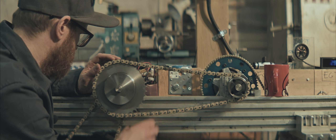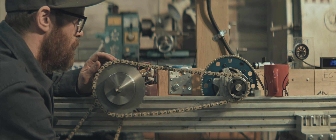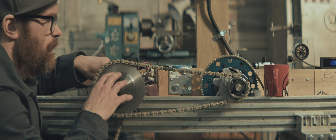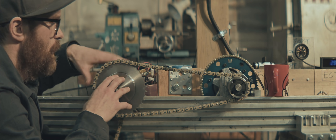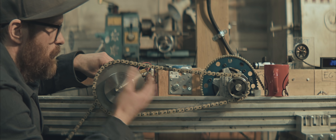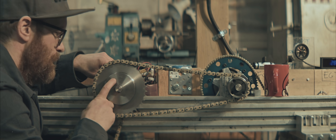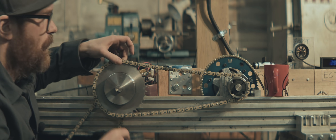I think there's far too much reduction here for the retarder to work properly. The retarder is having a hard time spinning so slow. It might be a good idea to take out the second jackshaft. Will the engine be able to start and rev up without that extra amount of reduction? Who knows — let's find out.